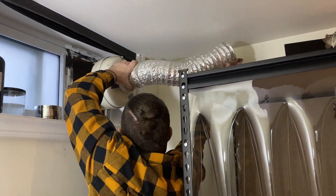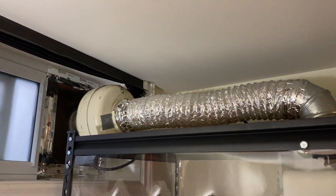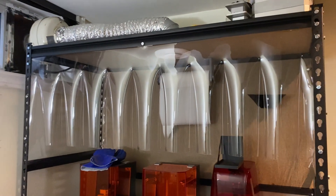Now that you have the fumes contained, it's a good idea to actually do something with them and get rid of them. We have this inline fan which is 300 CFM — cubic feet per minute — and it is strong enough that all the fumes create an updraft around the skirt and it pulls everything up and ejects it straight outside. I don't smell anything; it's working out really well. We have this on a dimmer so we can adjust for noise depending on how long we're dealing with those smells. This isn't the most energy-efficient solution due to heating, but it's the most direct and long-term cheapest option. We had this fan ducting from a previous studio where it was used as casting burnout kiln ventilation, so we knew it was strong enough to pull out smoke and fumes already.